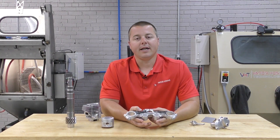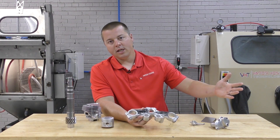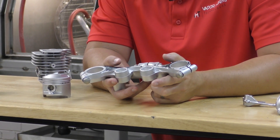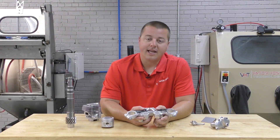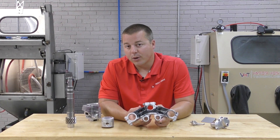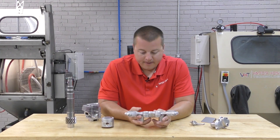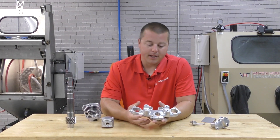Some people opt for buying two machines — setting up a cutting abrasive in one and a polishing abrasive in another. Others strip the coating using different means, though I would not recommend that for high volume. Some people are even dry blasting the part with an aggressive abrasive at lower pressure to remove the coating and then vapor honing after.